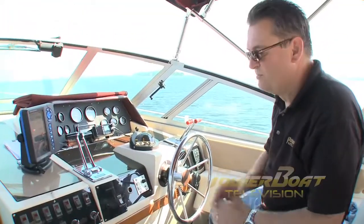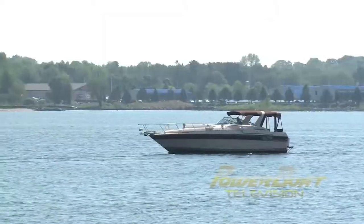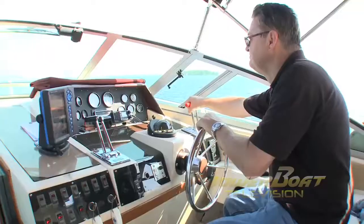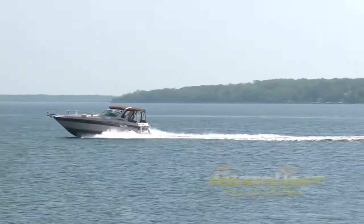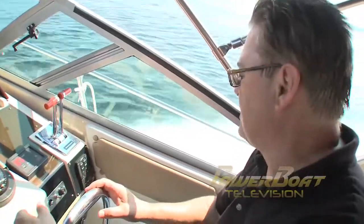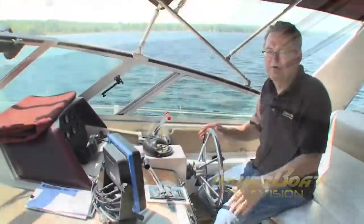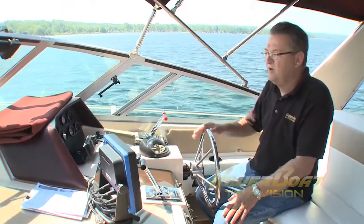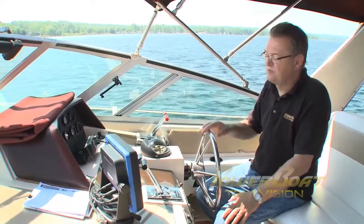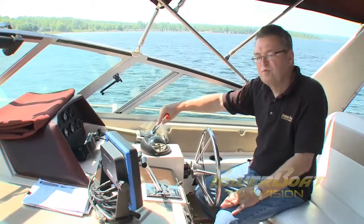We finally launched the boat in the spring — now it's time to try out the new Bennett tabs. The first thing we tested was how much improved the hole shot is. The result was amazing, really greatly improved. The boat came up quite flat, and for the first time running at 3500 RPM with only half the tabs deployed. The larger tabs have given this boat a much better hole shot — coming out a lot flatter and quicker. The automatic tab control keeps the boat in the attitude where it runs the best, even through the turns. Bennett says with the larger tabs and the automatic tab control, over the season you should notice improved fuel economy.